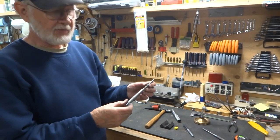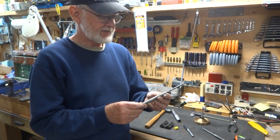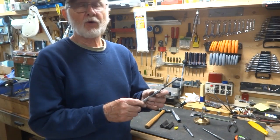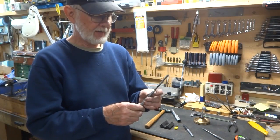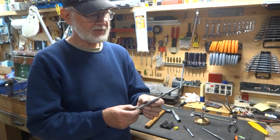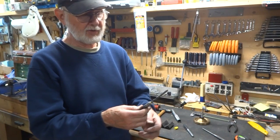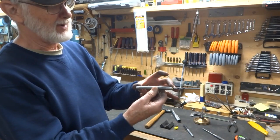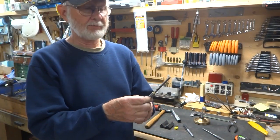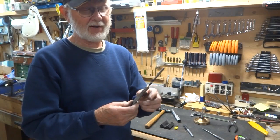Well, this did not come out as nice as I thought it would. That's not the best knurl I've seen, although it doesn't matter a whole lot for something like this. My letter D drill must have had a little wobble in the chuck, and the hole was too big to press fit the drill in — it was sloppy. I ended up having to braze it in. Now the end did harden up nice. I gave it a few whacks against something really solid and it didn't shatter. So it is a functional punch, made from a drill that was totally broken and useless — maybe 25-30 cents worth of metal. You've got a punch that will work. I certainly hope you'll do a better job than I did. This should press fit and stay if you get it right, which I didn't.